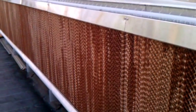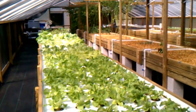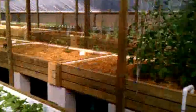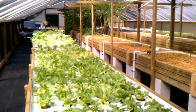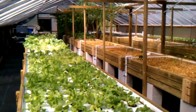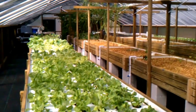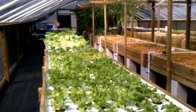The process is this water running down the pad creates a cooling effect. When the fans kick on on the other side of the greenhouse, all that cooling effect is pulled through because they're pulling the air out of the greenhouse. The way this is designed, when both fans are running, it'll do one full air exchange per minute.